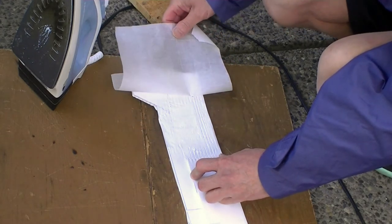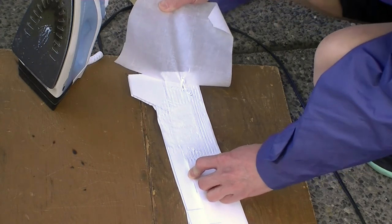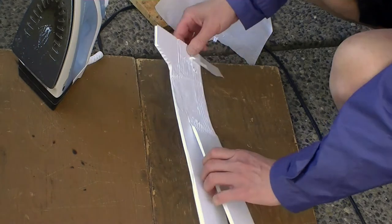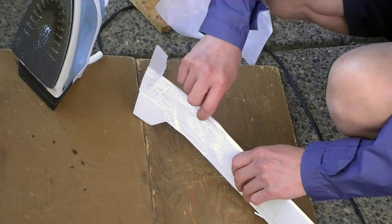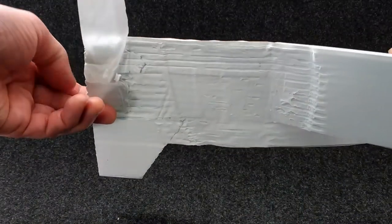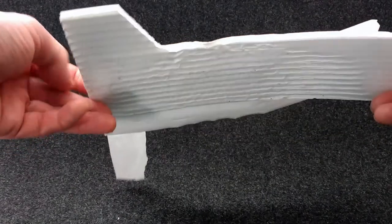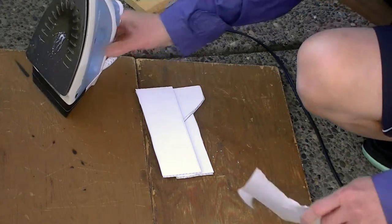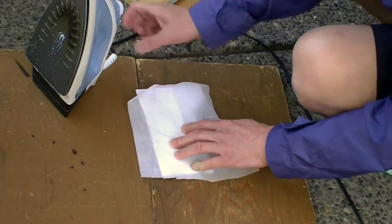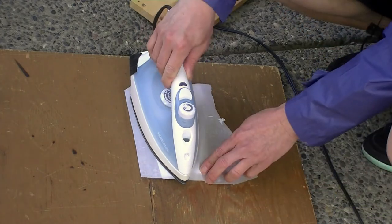I used a little more pressure and both layers collapsed and fused together — they are very strong, like a solid piece of plastic. I wonder if I can fold it. The surface of the joint doesn't look great but it is really strong, and it is a very good way to fuse two sheets together. This time I try not to apply too much pressure during fusion so that I won't collapse both sheets — I just want the top sheet to collapse and fuse to the bottom sheet of the coroplast.